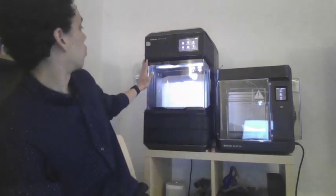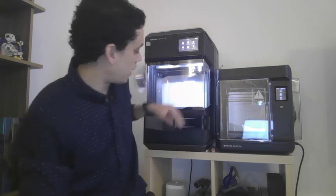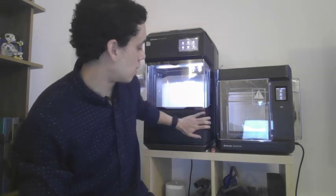Is polycarbonate hygroscopic? Okay. How to keep filament free of moisture? Yes, so you should avoid exposing the filament as much as possible to humidity. I only keep it outside when I'm printing with it. The reason is because you're actually side loading the material on the printer. These spools, the one downside that they have is that since they are not MakerBot spools, they won't fit inside of our drawers. The drawers are there to control the humidity of the material. So since you don't have that, you really want to be conscious about where you store the material, just keeping the material outside for as little time as possible.